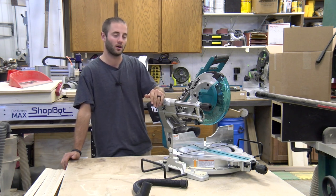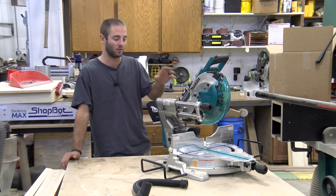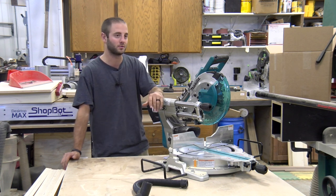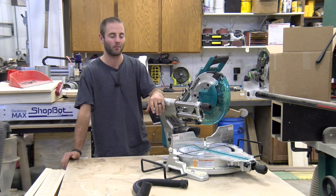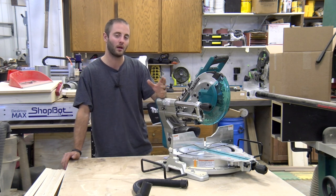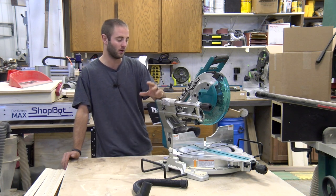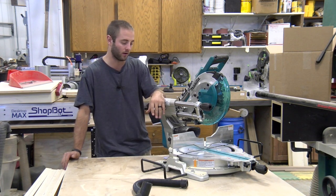The 42-tooth factory blade that comes with it is pretty impressive as well. If I was going to use this saw on the job site specifically for crown or base molding, or anything where you want absolutely zero tear-out, I would probably replace that blade and put in an 80-tooth blade just to hedge my bets and minimize tear-out.